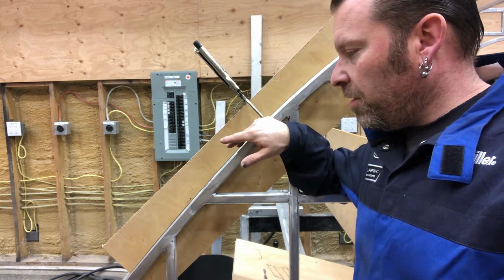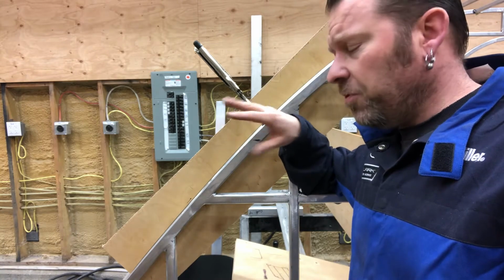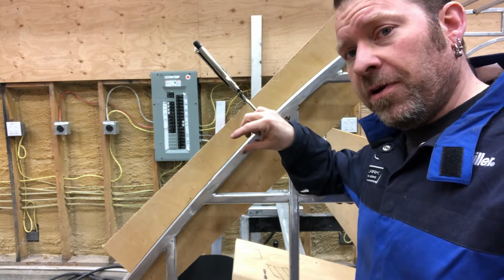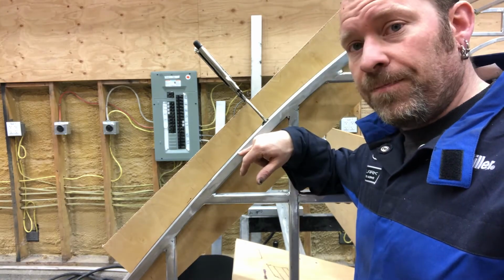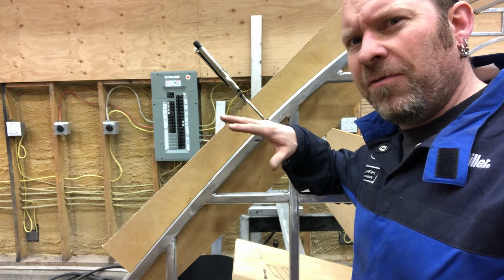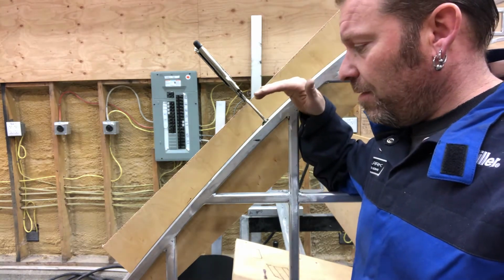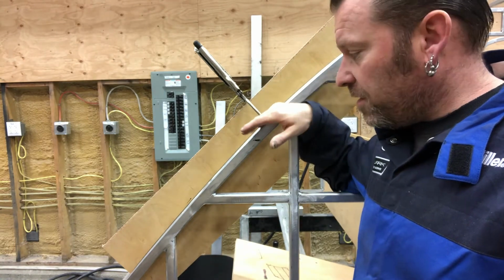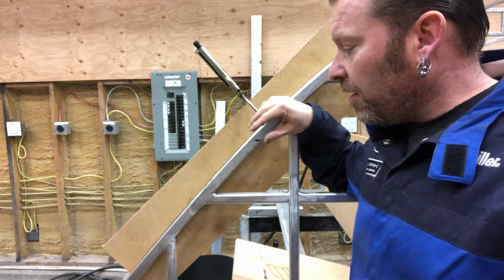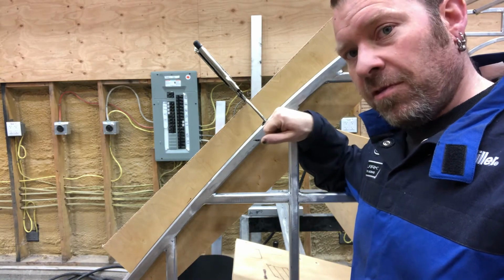So what you need to do, and with a seal under it, mine will have a seal, 2 seals, doesn't matter. Anyways, the seal setup takes about 1/4 inch. So basically you have to take this radius and make it 1/4 inch bigger, or it'll want to lay funny. It won't want to close, it'll be too tight because it's compressing too fast because it's the same size as this and it needs to be bigger because it's on top of it. So I'm adding 1/4 inch to these bars, so it's a different radius than the outside, slightly.